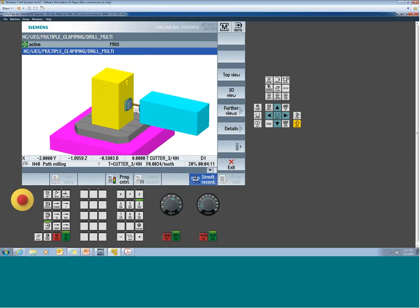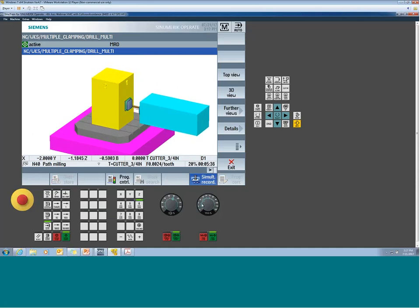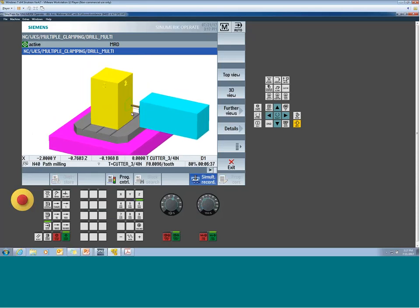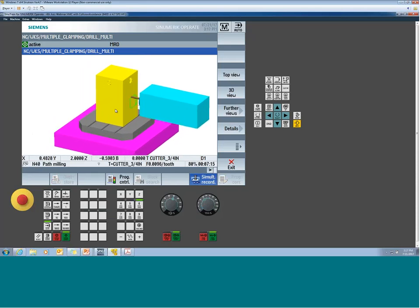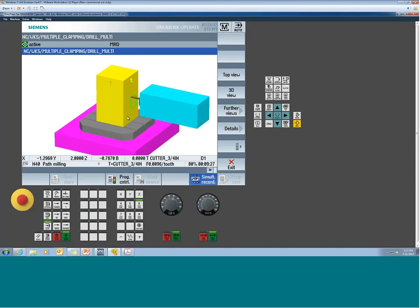So that's why I like to turn on the wireframe. So just your show path option. You'll see the blank at station 1, but when you get to station 2, station 3, you're just going to see the wireframe. And then when we get back to station 1, it'll show you the next op, and it won't retain each op because inside of the result file, it's actually resetting up the blob or the blank every time. So that's about the only thing.